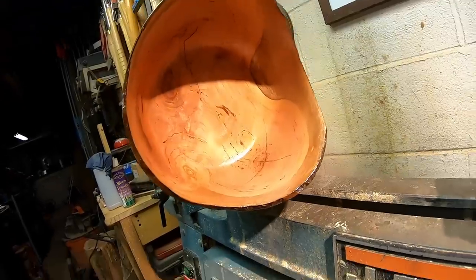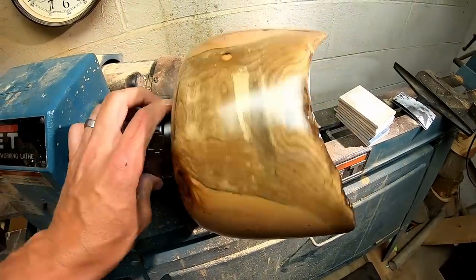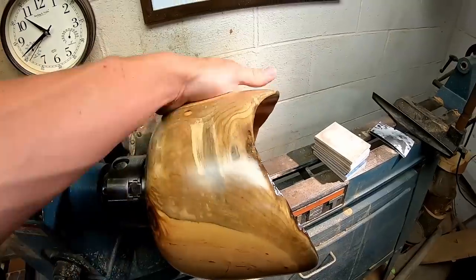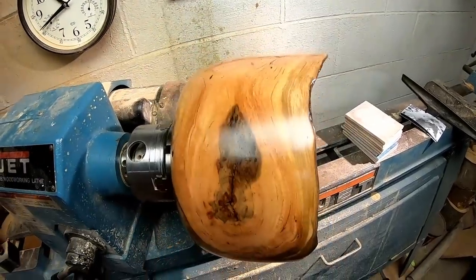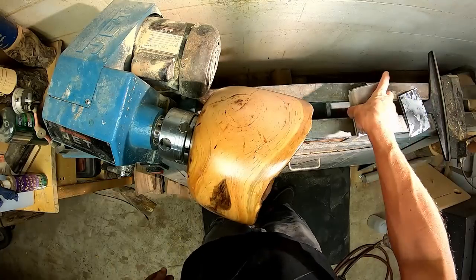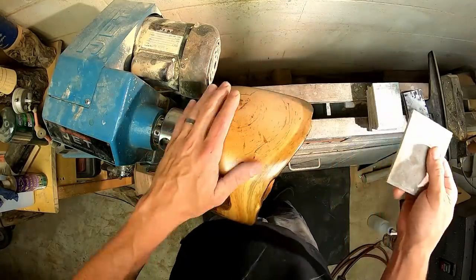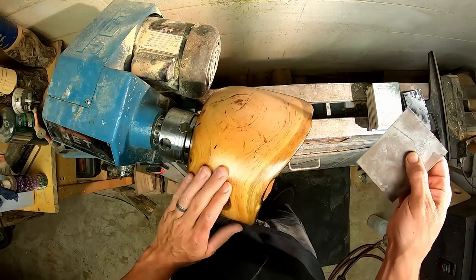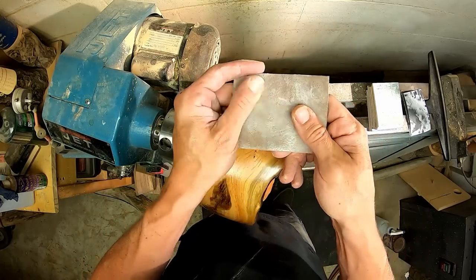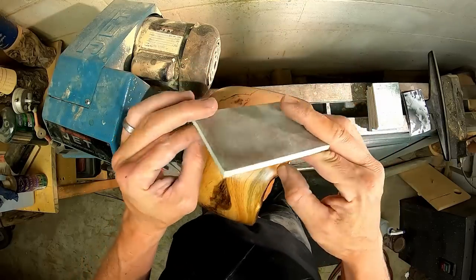But nah, it's looking pretty good. I'm liking the shine. I'm liking the way it's bringing out the grain. Got some good shine in the sapwood here. Just going to work on through it. And by the way, this is a dry micro mesh sand out. This stuff sands real nice, real easy. It will eventually clog up the micro mesh, but you can just blow it out with the air. Not a big deal.